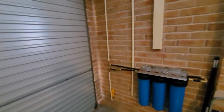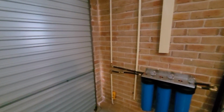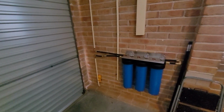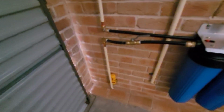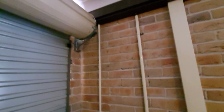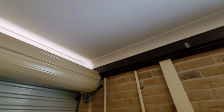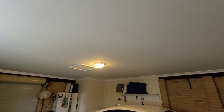Two ideas came to mind to connect water to the washing machine. I'll take you through both, and then the one I've chosen. So you might be familiar with this water filtration system installation. There's a video about it on my channel, but basically the water comes in from the bottom there, through the filtration system, back out, and then up this line here into the ceiling. And then it basically just runs across diagonal. It's 20mm PEX once it gets into the ceiling, across to the internal door to the house.